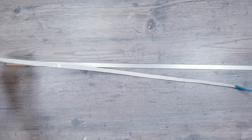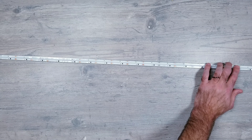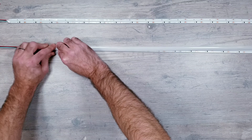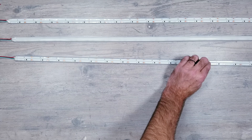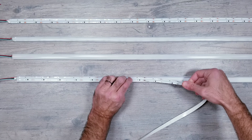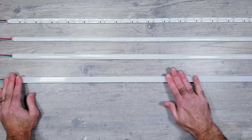To set things up, I'll first put one section of lights in our shallowest profile but leave the diffuser off so we can see how it performs with no cover. Next, I'll put a section in the same profile with the diffuser added — that's the 4.8mm, the shallowest of the three. Moving on, I'll get another one set up in our mid-level 6mm profile, and finally our last one will go in the tallest channel with 12mm of clearance.